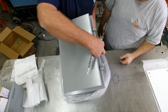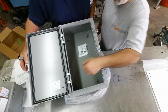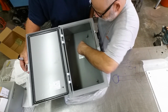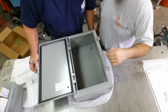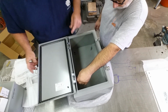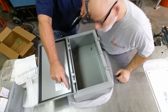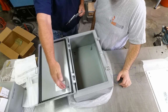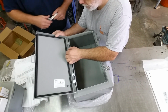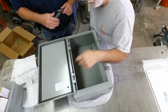And then our cabinet, nice size. Looks like it's either powder coated or industrial baking enamel. Those are the parts to mount your sub base. Oh, it's got a box ground in there, so that's nice. Well, that's a jumper to your lid. If you've got components in the lid, it has to be grounded. Oh, check this out. Look at this. It's got a removable, easily removable door.